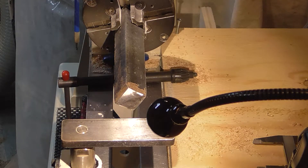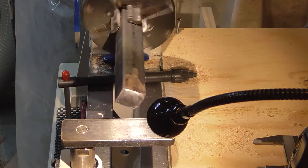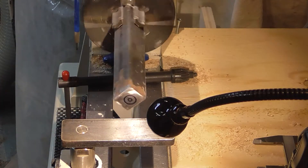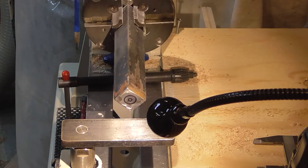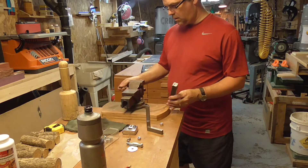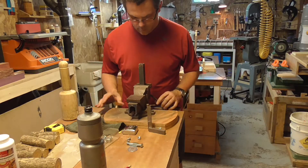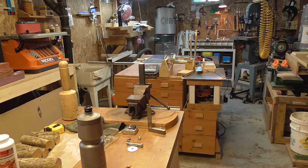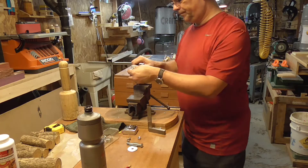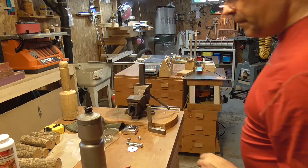The bar is in my chuck and my intention is to rotate the bar and make a circle with a sharpie. This should help me find the center, and this is where I'll punch the bar. My circles seem not centered — one inch, one inch. This thing is absolutely square, but I don't trust my circles.